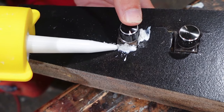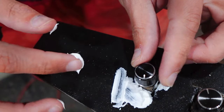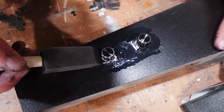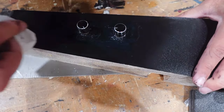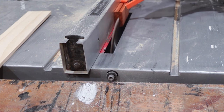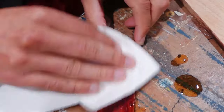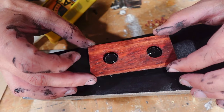The lighting on this bench is controlled by two dimmer switches running through one of the outer backrest two-by-six supports. I caulked them in space, trying to be as clean as possible, then came back and did some touch-up paint. After noticing how messy that looked, I made a cover from a small off-cut piece of padauk hardwood — drilled out a couple of small holes for the knobs with a Forstner bit, applied a little oil to harden it, and attached it with construction adhesive.